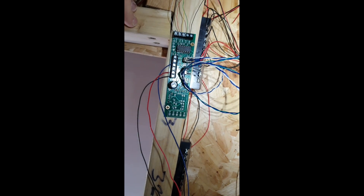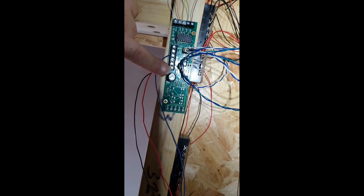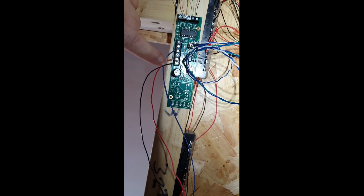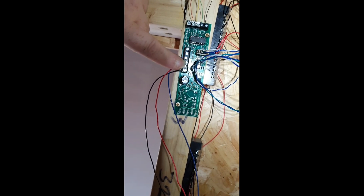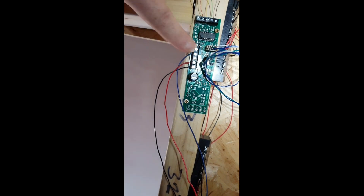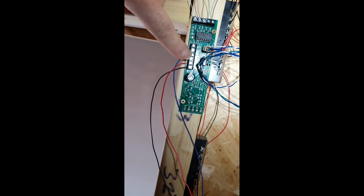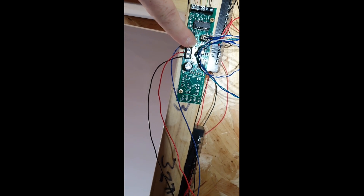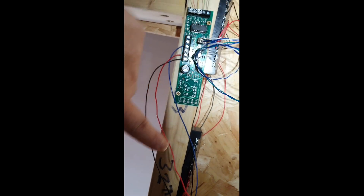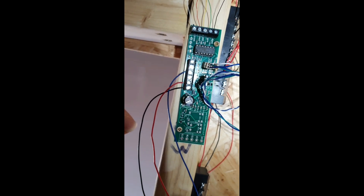So I'll go through the wires again. The negative wire goes into the first port, the second port is your positive. Your third one is the send - this would go to the next ERDAS4. The fourth one is the receive. What this does is, once the train goes past this block signal, it will send a signal to the next ERDAS4 and the mass sequencer to say the train has just passed, it's gone to red, expect a train.